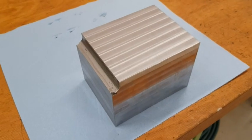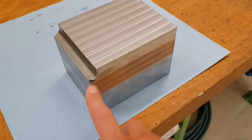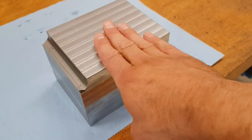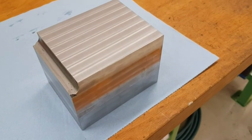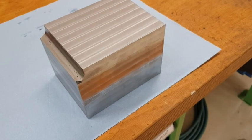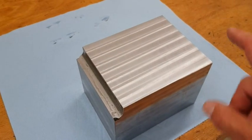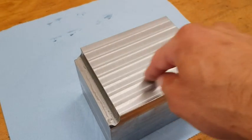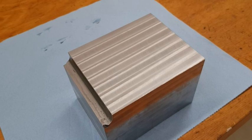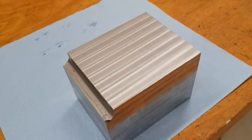I have finished machining the piece, facing off all the sides. Everything cleaned up except the corners there and there — it does not really matter, it is not a functional surface at all. This is the back side, this is the side towards the shock. Now I will start drilling holes for mounting, for coolant, and milling slots here. We have mill slots here for the tabs, and a circular indentation there for the spigot or coolant seal.